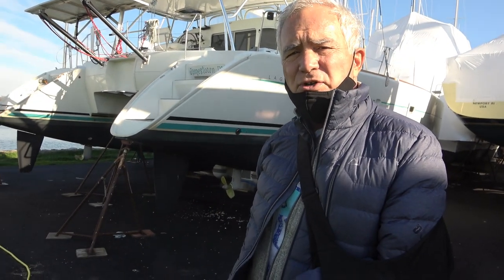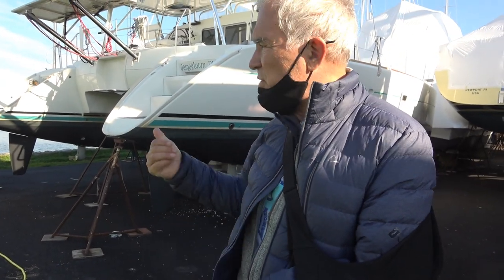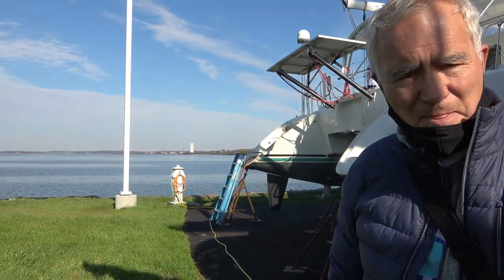Our vessel has been configured to use either 120 volts or 240 volts, we don't care, because it's the same wiring, same everything else. It's just the transformers inside which take care of the conversion, since we only charge a battery from the dock, and then the AC is provided by the inverter. Is that it? Yep.